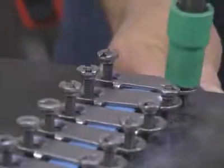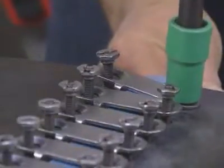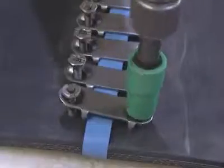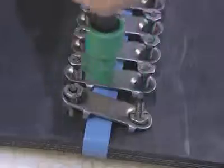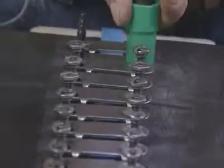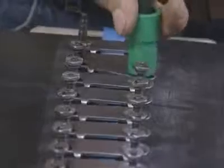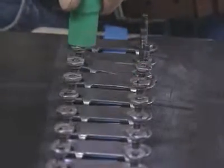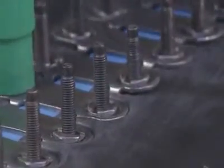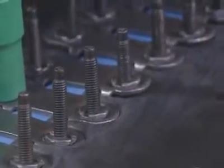Pull the tape tight and hold in position by tightening the nuts on the fastener at each end. Then tighten all other plates, starting at the outside edge and working toward the center. Be sure to tighten all nuts to the same approximate pressure. A properly tightened plate will show a slight puckering in the belt along the edges of the fastener.